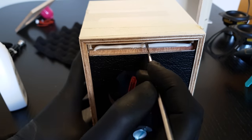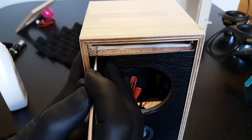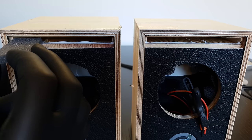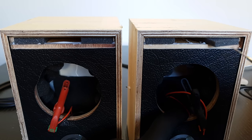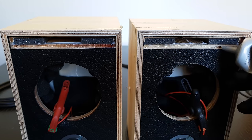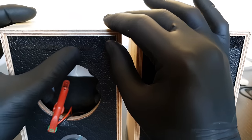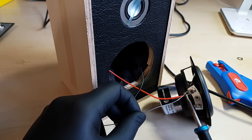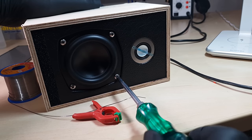The designer suggests caulking silicone for these extra seals, but I only had the cheap vinegary hardware-store variety. Had I used that, the speakers would probably emit subtle but unpleasant wafts of vinegar whenever I play something louder in the months to come. Before the glue cures completely, we insert stripes of thin acoustic foam into the sides of the ports, then cover them with the mostly decorative open-cell material. When everything has cured, you solder the final remaining joints, connect the rear panels, and screw everything together.